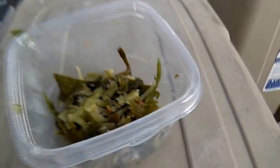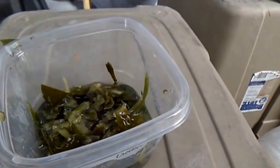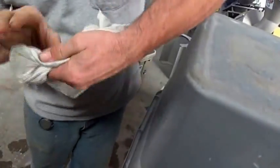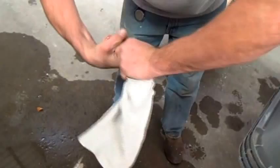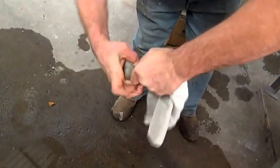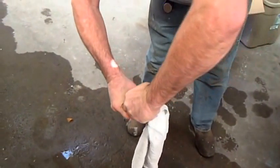This is some of our shredded material. We're going to wash it with isopropyl alcohol, then squeeze out the alcohol and see what we did. We pushed it into a ball and squeezed the alcohol out. We washed it with alcohol twice, simulating a counterflow wash system. We'll take this cake and run it through the oven.